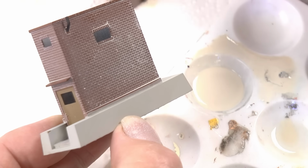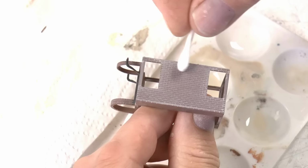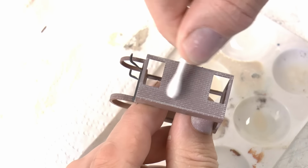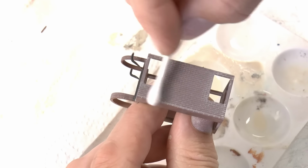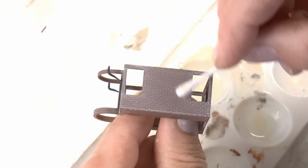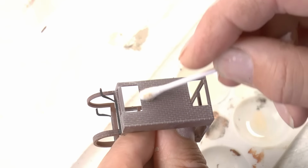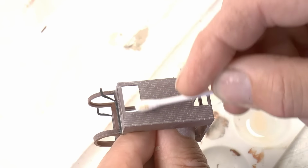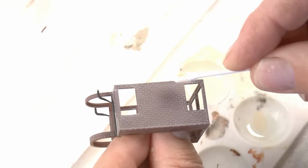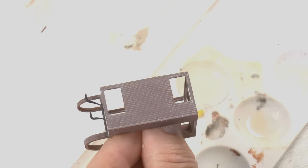Absorb excessive paint using a dry brush. There might also be some white paint landing and drying on top of the tiles. Dip a cotton swab into odorless turpentine and swipe it over the surface without any force, and that will do the trick to remove that paint. It took 2 applications before I got a good looking tile grout filling in between the tiles.